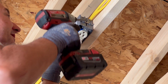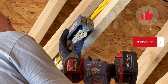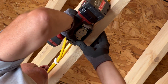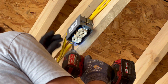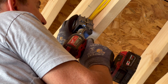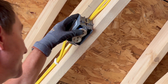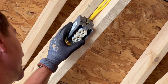If a light went off in your head that you can wire your garage like this - put all the tops one way and all the bottoms the other way - you can do some really useful stuff off of one outlet. Don't confuse this with a half-hot on the same circuit that you might find in bedrooms with a switched outlet. In that case, they only break the hot side; they don't break the neutral. But in this case, with two circuits, we want to break the neutral too. This is a half-switched outlet with two different circuits - not a half-hot.